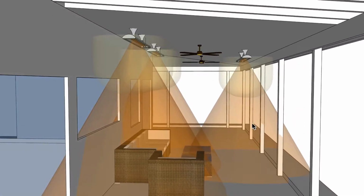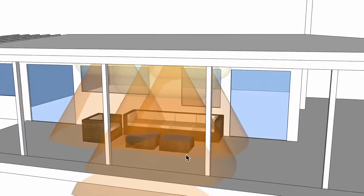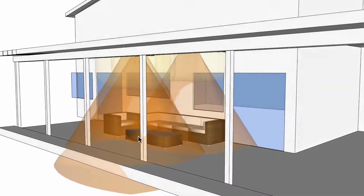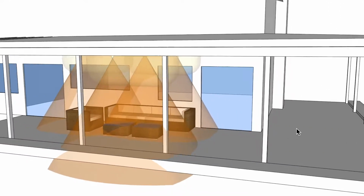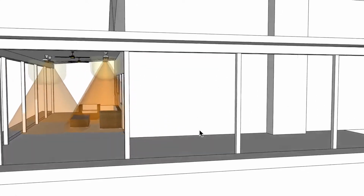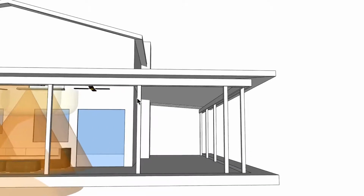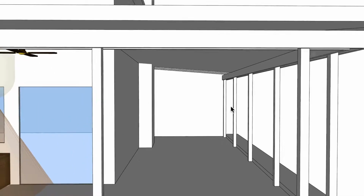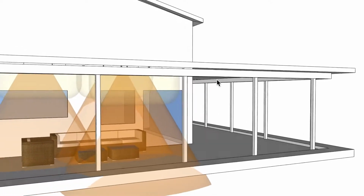Now, unless there's seating out here, I really wouldn't consider placing this unit here. I'm just guessing that this is where they're talking about the additional unit. It could be that they're wanting to place another unit over here, and if that's true, then I would just go with placing it centered over the seating area and 18 inches off the wall, just like over here as well. So 18 inches off this wall here, and then the unit would be parallel with the wall. Not sure if there's fans up here as well, but that's something else that you have to consider and keep in mind.